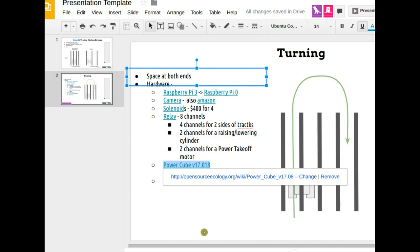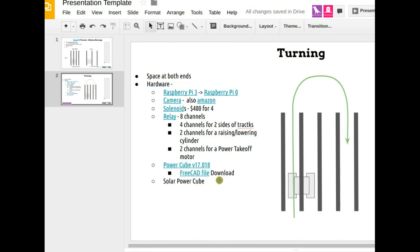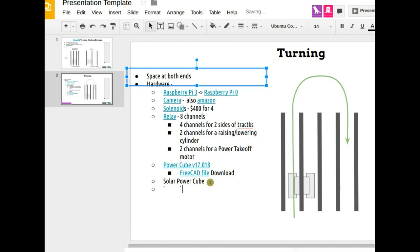Like the expected rate, we did a 1 kilowatt power cube before, so expected speed there is, let me just give you some numbers. Let's translate that to meters per second, or kilometers per hour. So 14 feet per minute at 1 kilowatt, we expect 1/5 of that, which is, let's say, 2 feet per minute at 200 watts. Which means over a day, the important part is how much do we travel in a given day, how much can we weed in a given day, and we expect, let's say, 6 hours of full sun.